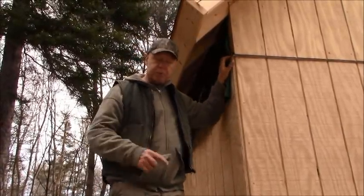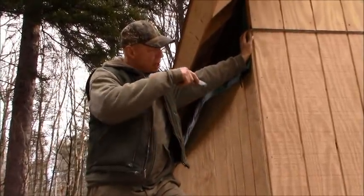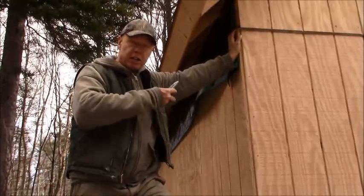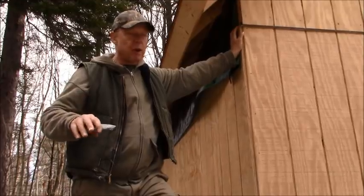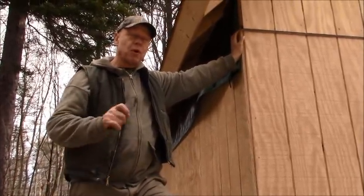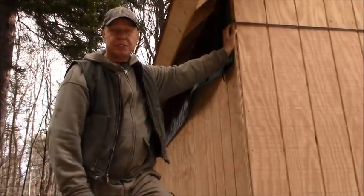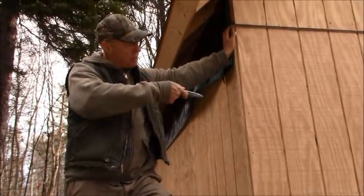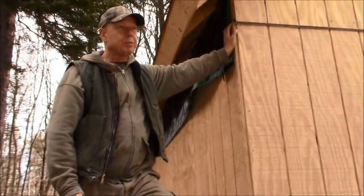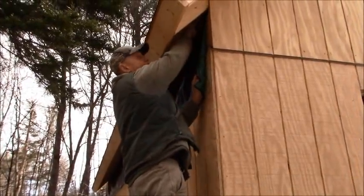But all the tarp upstairs that we're going to cut free won't go to waste, because after we bring the grade up inside the garage, get all that gravel compacted at the grade I want, I'm going to lay that tarp down on top of it before we put in those rubber stall mats. And it's going to be the perfect size, because it's the same size up there as it is down here. So we sacrificed the tarp, but really didn't waste anything. Yeah, man. Everything's going according to plan.